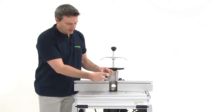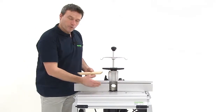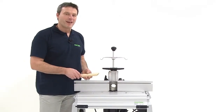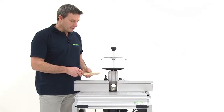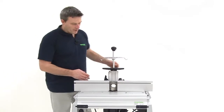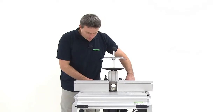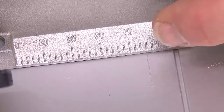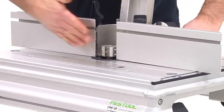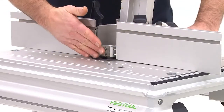This router is then turned. The mill height and depth should be 8 mm in this case. I'll carry out this adjustment with the corresponding scale in the rear area. The scale enables me to adjust the router to this stop, to position zero exactly.